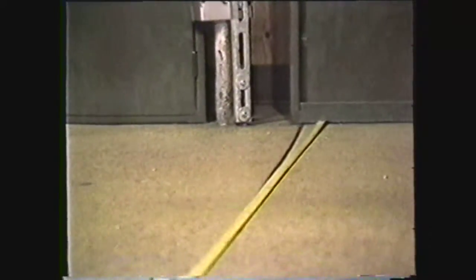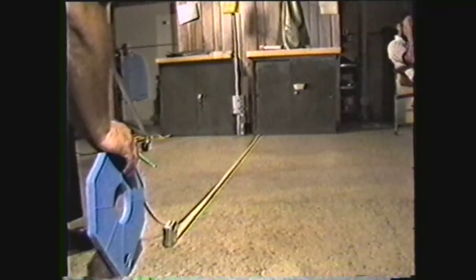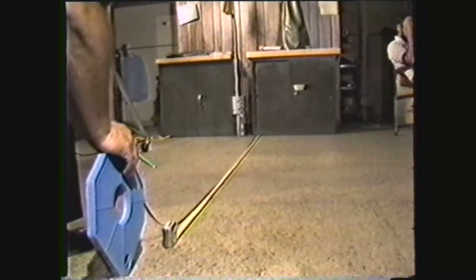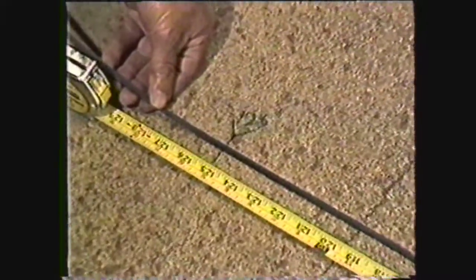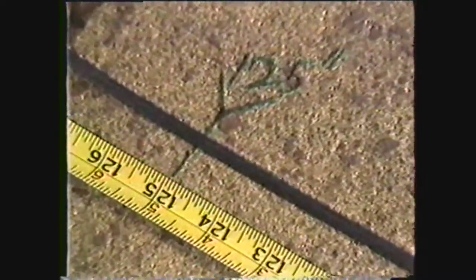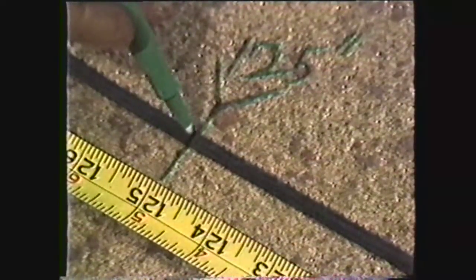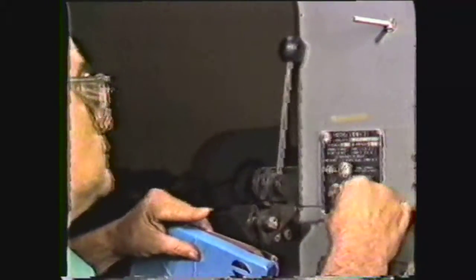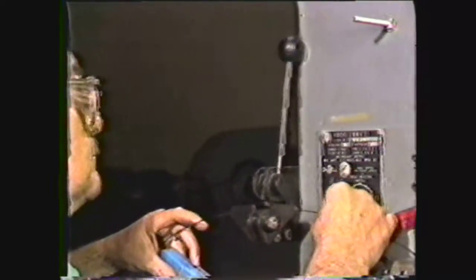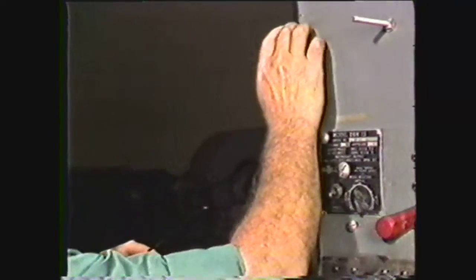The next step is cutting a length of blade 125 inches from a roll of stock. Use a tape measure to lay out the length. In many shops, specified dimensions are placed on convenient surfaces so that one person can handle the measuring operation. Mark the blade length on the blade stock. Then use the blade shear to cut the blade to length, ensuring the blade is aligned against the shear guides. Apply a quick snap of the shear handle to assure a cut that is square to the back of the blade.